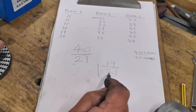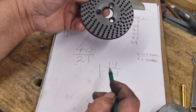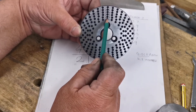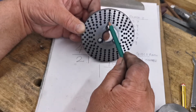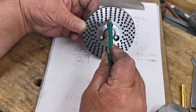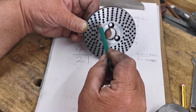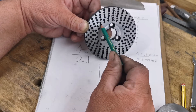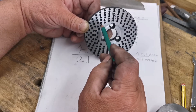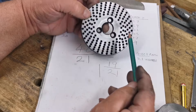So that's 19 holes out of 21. You put your pin in, cut the first tooth, then do one whole revolution followed by 19 out of 21 holes — that'll be going around: 19, 20, 21 — then your pin will be in there for the next tooth cutting. One whole revolution, then 19 holes, and so on. Now let's get this set up on the dividing head.